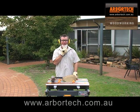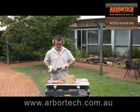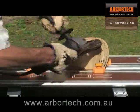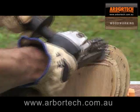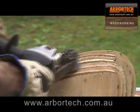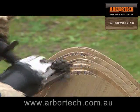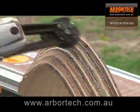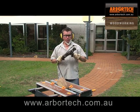I'm speaking loudly because I've got my earmuffs on. It's important when using the mini grinder to work in a stroking motion — this is the easiest way to use the tool. Also, when using the mini grinder, it's very, very important to use both hands on the tool at all times.